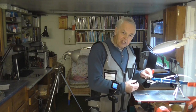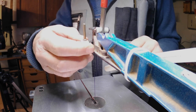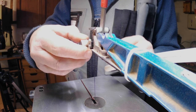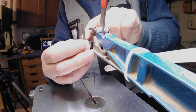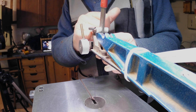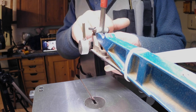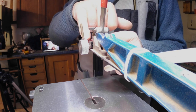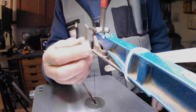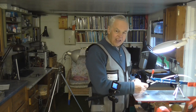When you're getting a bit older, your hands aren't as good as they used to be. When you're doing this knurled nut up and down all day — especially on a cold day with lots of cutouts — it is hard on your fingers. I found that this little rod makes all the difference: you can just do it ever so quickly. It's actually a little Meccano threaded pin — a proper Meccano part — and I've drilled a tiny hole through the narrow edge here, tapped it with a normal thread using a tap and die set, and fitted that little threaded rod in. Perhaps I should suggest it to Hegner.